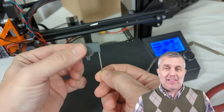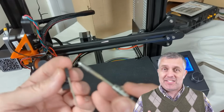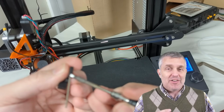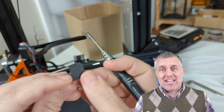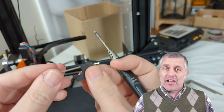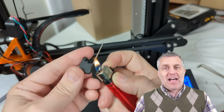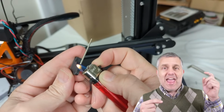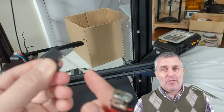Once the sensor pin gate assembly is at the correct length, you'll find that it has a little bit of wiggle, and I could have made the tolerances in the part a bit tighter, but it would have led to challenges during printing. So instead, what you'll need to do is use a soldering iron or a lighter to sort of melt and pinch together the plastic around the 2 ends of the little 3D printed geometry. This should stop the wiggling movement.